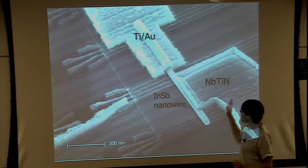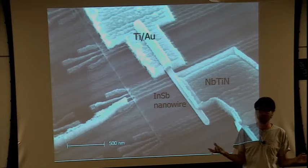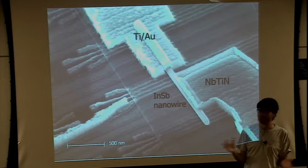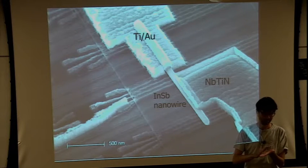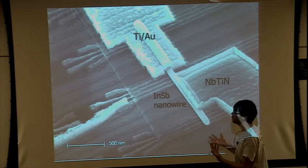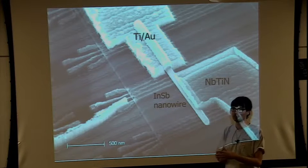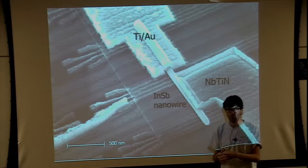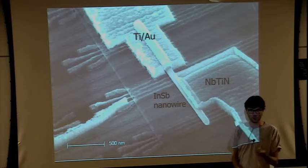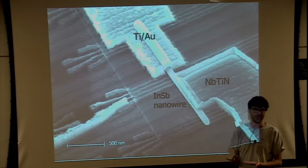So if we just lay down this metal on the wire, there will actually be no current. The resistance will be teraohms. So we have to clean it before we can make contact. And the way we clean it is we put it in acid, or we put it in some crazy sulfur compound, or we actually bombard it with high energy ions to scrape off the surface layer.